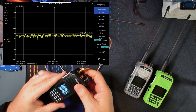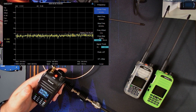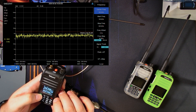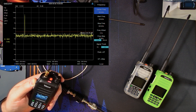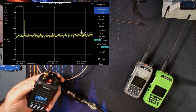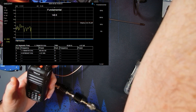We'll get the radio set up. Looking at spectrum between 100 and 500 MHz — let's start right off by looking at what it looks like when we key up the radio. It's looking pretty good. Maybe the harmonics on the Talkpods have been taken care of. Let's jump right over to the harmonics at 146.5 MHz and see what things look like.